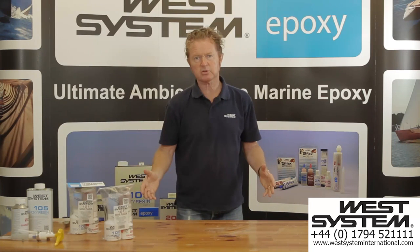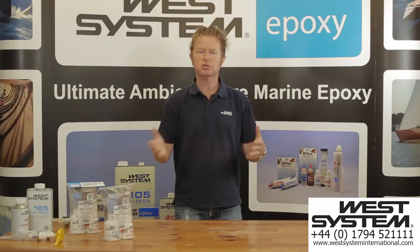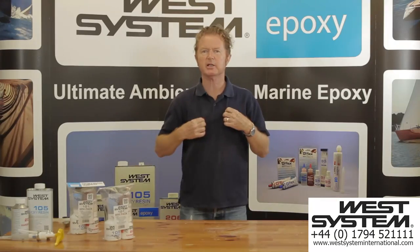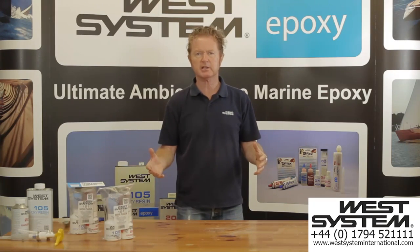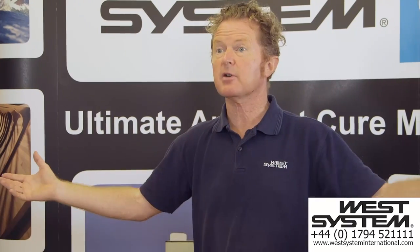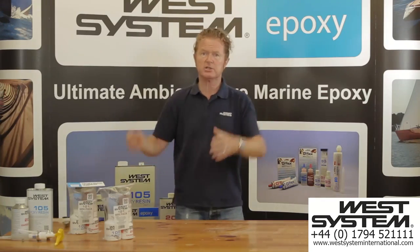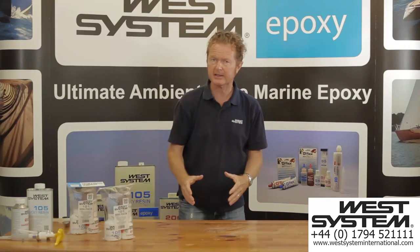Very important to have a good environment to work with. Your workshop needs to be clean, dry, free from dust. If you can wear a t-shirt comfortably, that is around about the kind of environment you need to be working in. You're not too hot, not too cold, and you'd feel if the environment was damp, and you'd also feel if it was dusty. Very important. If you're working outside, you can tent an area off and bring in some localized dry heat.